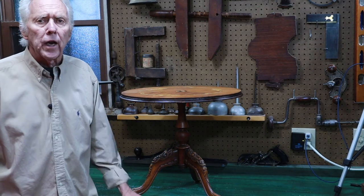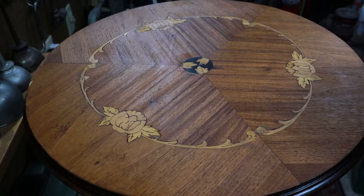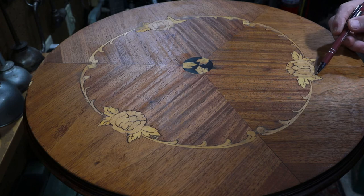While I was off camera, I put a couple of coats of very thin shellac to seal the surface. I also put a dark stain around the rim, which ties into the darkness of the legs. This is what it looks like after the repairs.